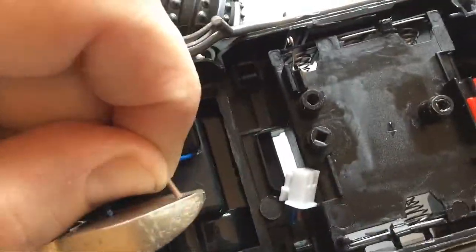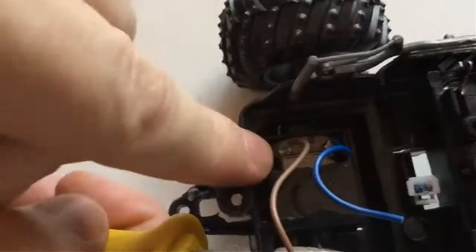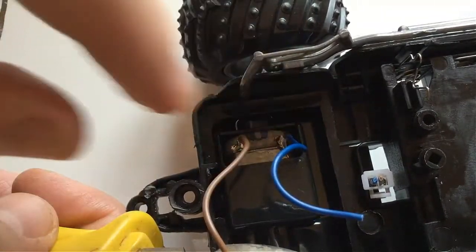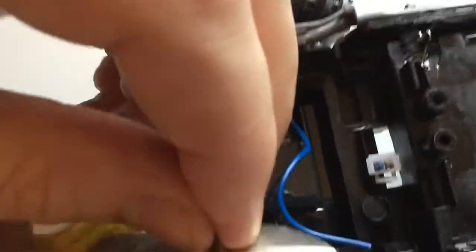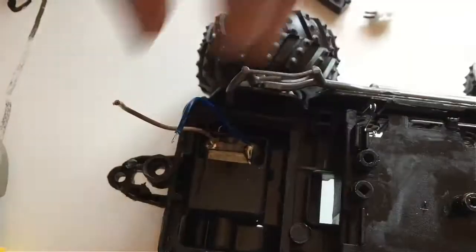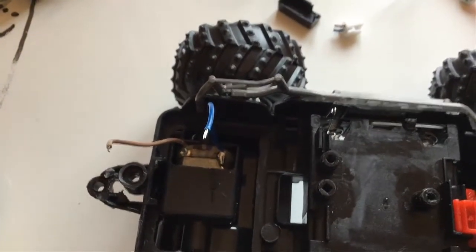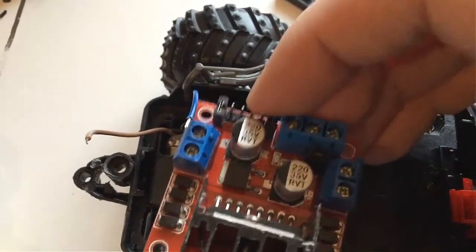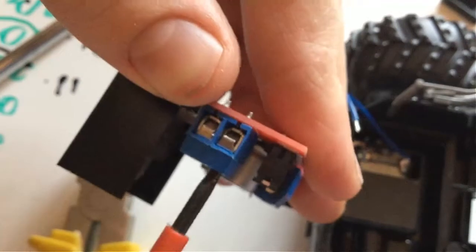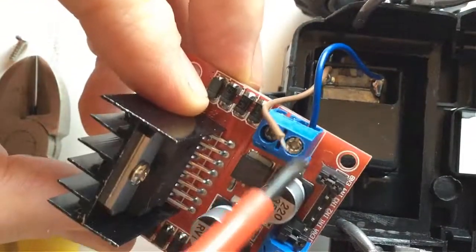You want to strip the wires. You can see the motor is connected to the two terminals - you can put that plastic shielding back on. You might actually want to just solder your own wires onto it instead if needed. To insert into the terminal block, loosen the screws - righty-tighty lefty-loosey - open the jaws, put your wire in, and close the jaws to tighten.